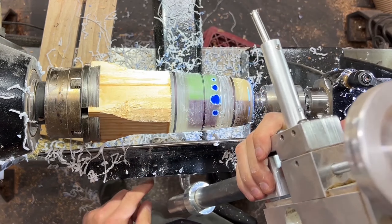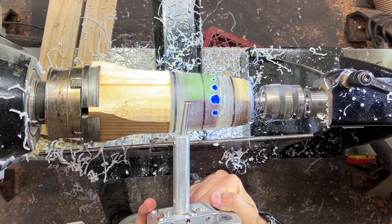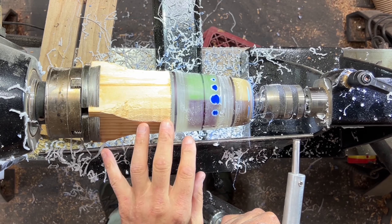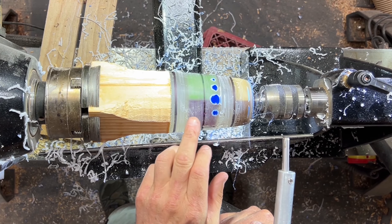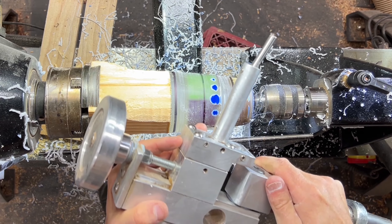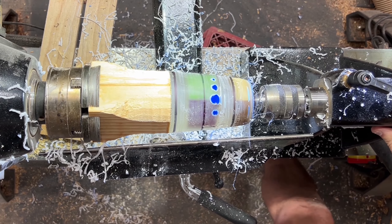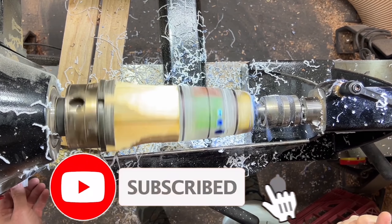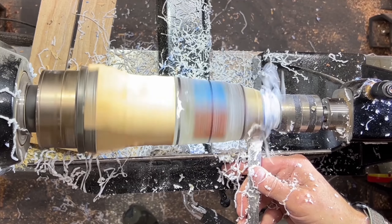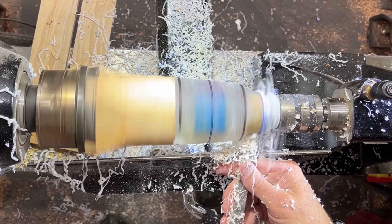The next step is to remove most of this area because it's all sacrificial — there's a piece of wood embedded in the resin earlier so my center point has a good place to grab. Between those two reference lines will be my eventual ball. I'm going to use a jig I recently got from a company called Chefware Kits — US domestic made. This mounts on my banjo and sweeps back and forth on top of the ball, but the idea before using the jig is to remove as much material as possible and get the sphere as close to round as you can first.